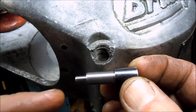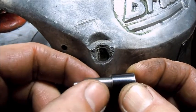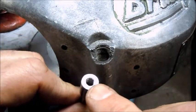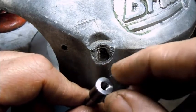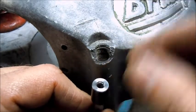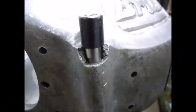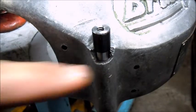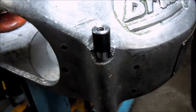I've got the little pin spun up. I think it was three-sixteenths and eleven thirty-seconds, and this was just a half-inch rough stock. I did drill and tap a quarter-20 in there just in case — a couple of things I could do: I could put a bolt in there and turn it, and then put a dowel puller on it and pull it out as well. That gives me some room to work and fill this all in. I may actually turn it so it's standing up so I have gravity helping me.